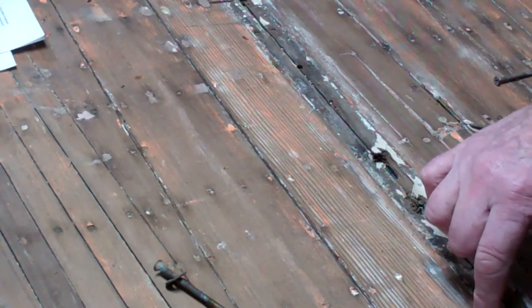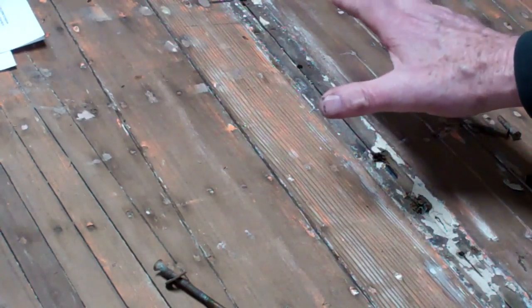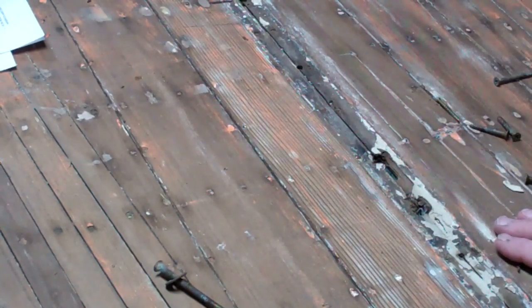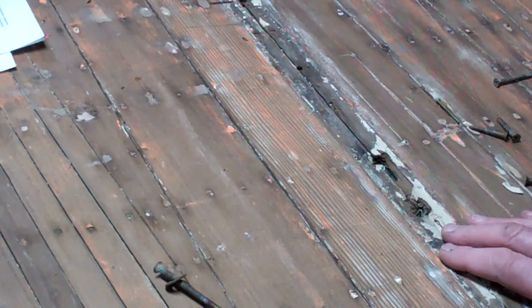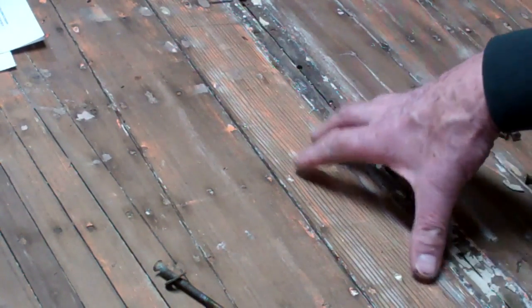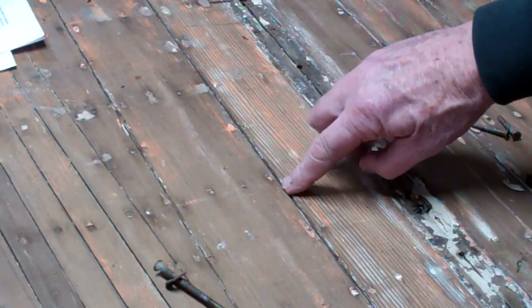We will create a bed of 5200 the entire length, set the keel into that, fasten it from the inside as it is fastened. There'll be quite a bit of squeeze out of 5200, but we'll clean that in precisely the same way that we clean the seams on a true 5200 bottom, where the planks are screwed down and we get a fair amount of squeeze out.